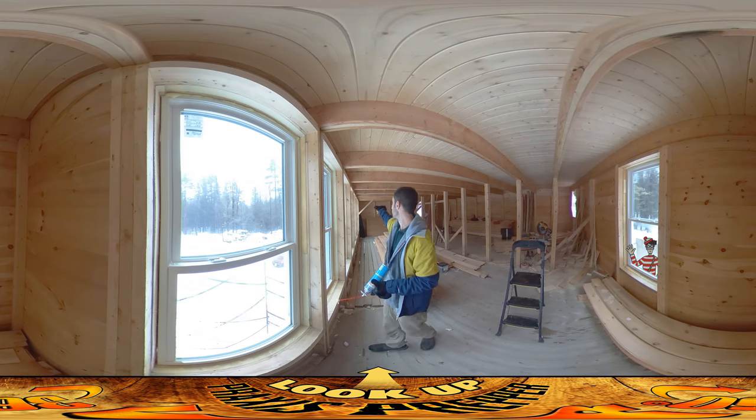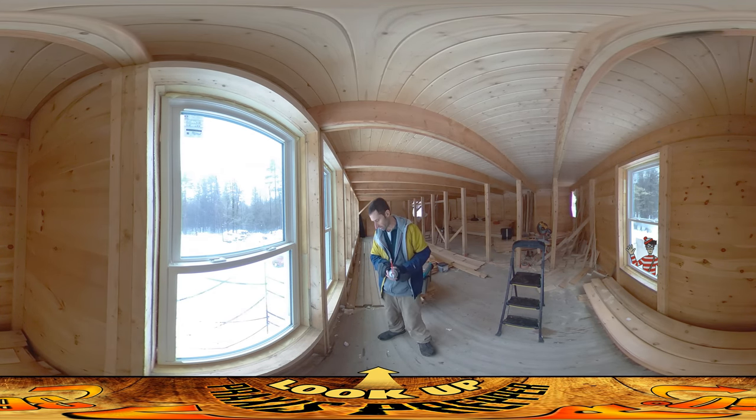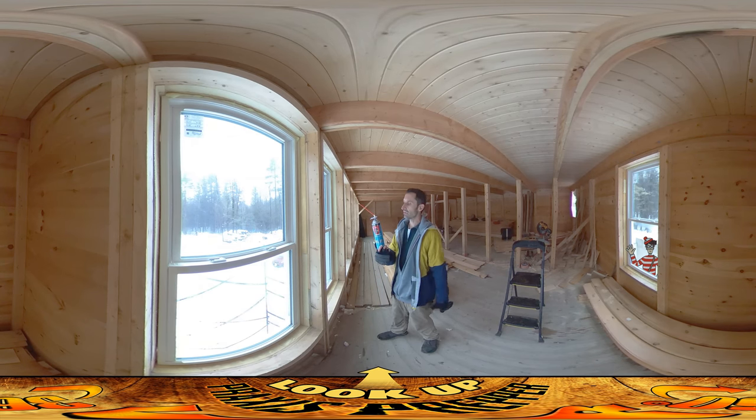I did most of these windows — I've got some more to do upstairs. By the way, if you ever get this stuff dripping, just let it set and harden, then it's really easy to pick off. If you try to wipe it while it's wet, it makes a real mess. Just let it do its thing, don't touch it, and later it'll pop right off. This is a 16-ounce can, and one can seems to do about four, maybe five windows of this size — almost three feet wide and five and a half feet tall. That's it, thanks for watching.